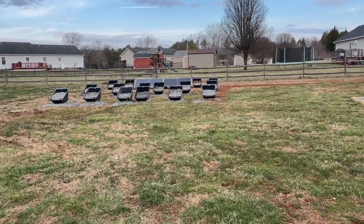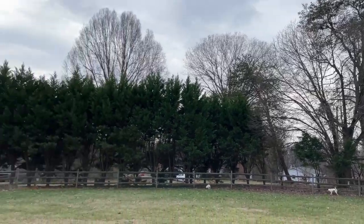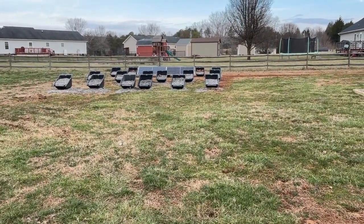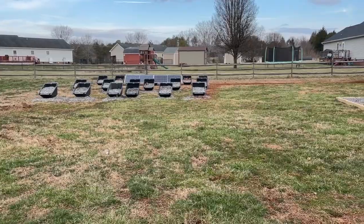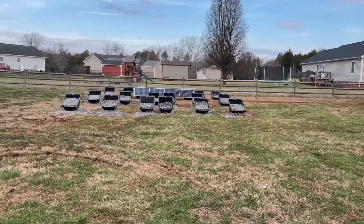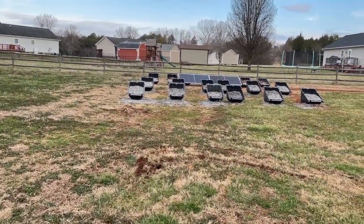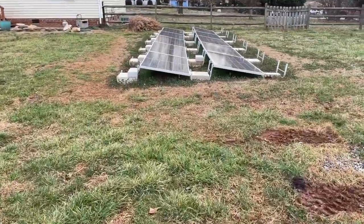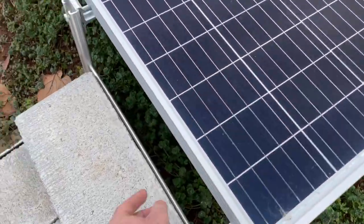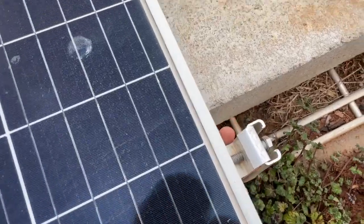They make a big difference morning and evenings, so I decided I'm going to take this apart and get it out of the shade of those trees over there — it was shaded in November, December, and January — and move it over to the sunny side of the yard at 25 degrees tilt. To take the panels off is a challenge. You've got to back off these bolts at all the points of the panel, push the panel — it's got a hook underneath that hooks into the frame — so you push the frame this way all the way, then lift it up.